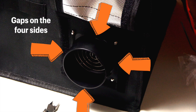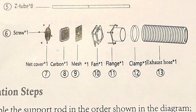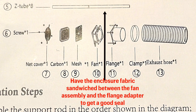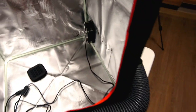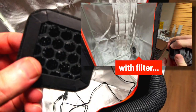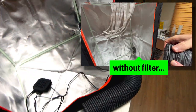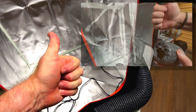The screws and nuts will be the only things securing it, so you'll have gaps — and that's not what we want. Instead, we can assemble pieces seven through ten, then the enclosure, then put on the flange to get a good secure seal between the fan, the fabric, and the outside adapter. When I tested the five-volt fan installed the original way, there wasn't much airflow, but installed our way we definitely get a lot more airflow, which is great.